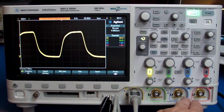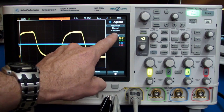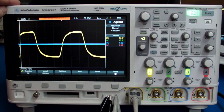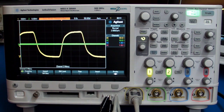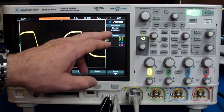these 2 separate channels, it handles them separately. If you turn on channel 3, look, it stays at 4 gig samples per second. So you can actually still run 2 channels side by side, both at 4 gig samples per second, because it can handle that inside the ASIC. But you switch on that one and it just can't do it. So there's a little trick. And the memory depth is going to halve too if you turn on the secondary channel, just like the sample rate.